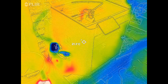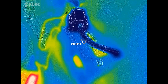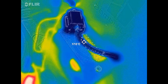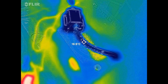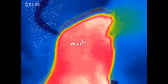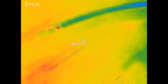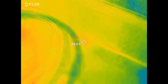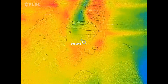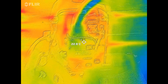Let's look at some thermal data. Looking at the Martillo Tech device, we can see it is indeed pumping some cold air. Surrounding air is around 20-something degrees Celsius, while the output is 17-something. Following the line, you can see the air stays cold — colder than the surrounding air — all the way down to the extruder, where the inside of the extruder is visibly being cooled by this system.